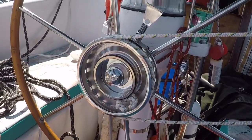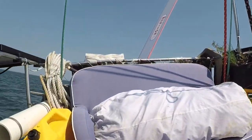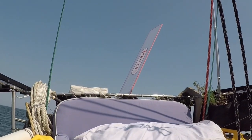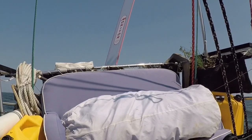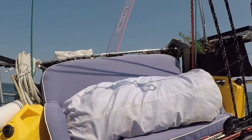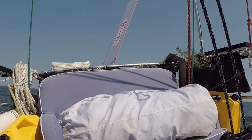That's it. And to set your heading, you simply turn the air vane so it points straight into the wind. So now it's flopped over to the side. So it's trying to make us turn to go more upwind. When it points straight up and down, it means it's directly on course and it's steering us straight. I hope that answered your question about our monitor wind vane. We call her Wendy, as she steers us along effortlessly and with no electricity.